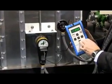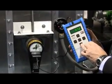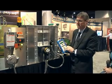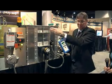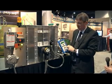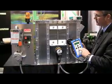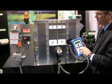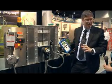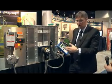When I reach the 10% underspeed point, I should get an alarm. For this demonstration, the alarm is connected to that light on the display there, and that should start to flash. Exactly at 90%, or 10% below normal speed, we get the alarm. And then at 20% below normal speed, the shaft should stop. So when it reaches 80 RPM on the display — exactly — it has stopped. Now we have verified in real time the reality of this machine. We've tested it thoroughly — not a simulated test.